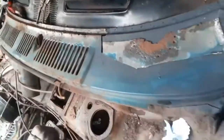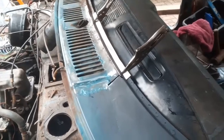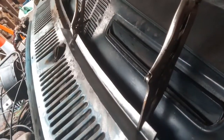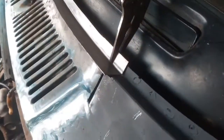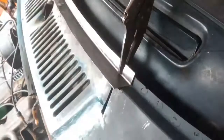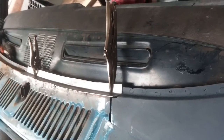So here we go — there we are, our first stage. And this bends both ways, so this flange bends and this flange bends, and they're bending opposite ways. It's only slight — you just have to tickle that on the stretcher/shrinker.